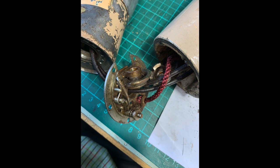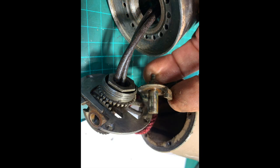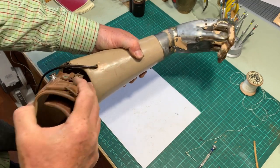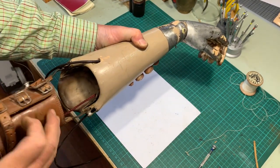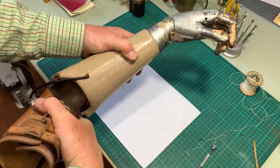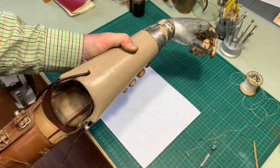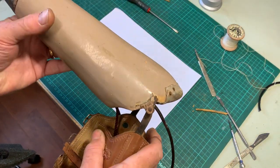In the Karnes hand, the wrist mechanism is tightly integrated into the arm socket. In order to remove the mechanism for cleaning and oiling, I had to drill out a blind rivet at the elbow joint. The mechanism can be seen here with the sliding clutch removed for cleaning. The turn mechanism for the hand was initiated by an additional cord. It was then turned off again and the hand returned to a fixed position by extending the arm suddenly. In later models produced from the 1930s, this wrist turn is not present — I presume it was slightly unreliable or found to be too expensive an addition.